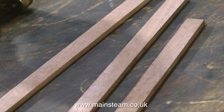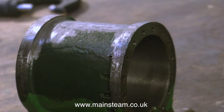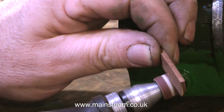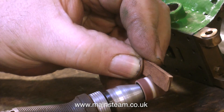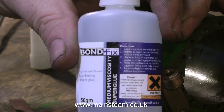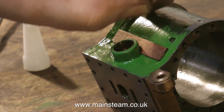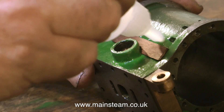This next section covers cladding the cylinder with mahogany strip. With mahogany this thick I have to chamfer the edges because of the curvature of the cylinder — if I put pieces back to back without chamfering there will be a big gap between each piece. Remember when doing a cladding job like this, it's the most visible thing on the engine — it's what everyone will look at. So take your time and get it right.